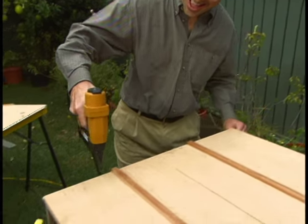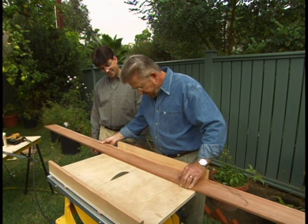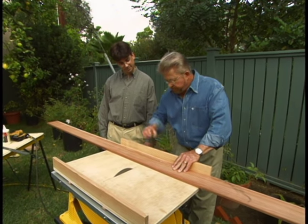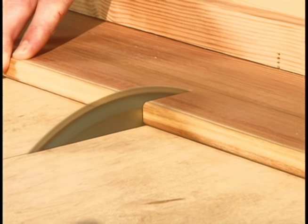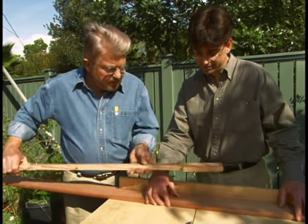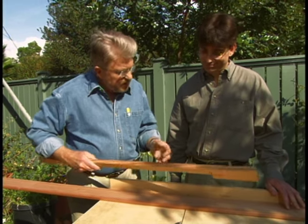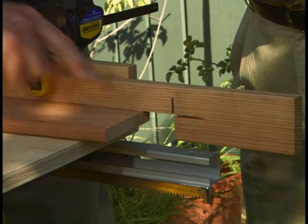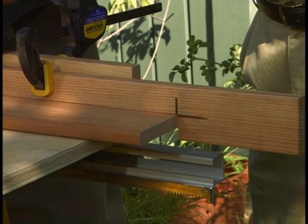It's a good warm-up for the mailbox, huh? It sure is. Let's try this out Steve — lay the board up against this edge, flip on the saw, hold both sides. This gives us a very accurate cut and a lot of control, so we're going to use this a lot this afternoon. This is called a stop block. This attachment can be clamped anywhere along the rear edge of the fence and once in place will enable us to duplicate pieces of lumber cut to exactly the same length.